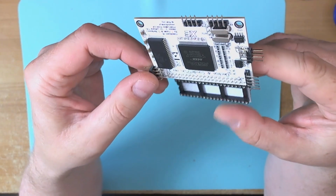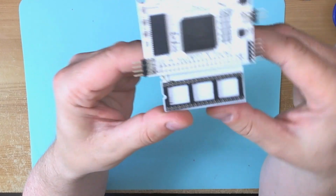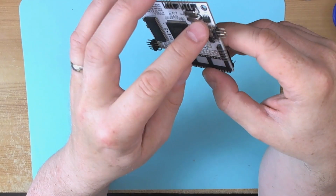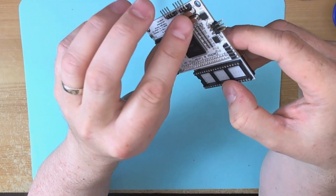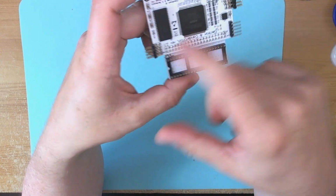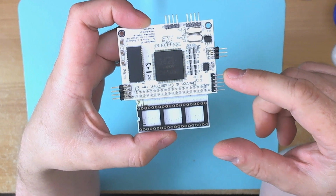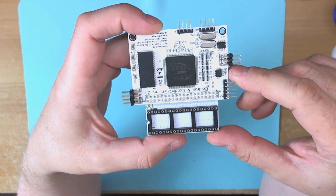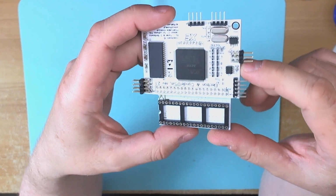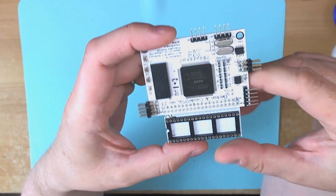This particular one's configured for an XL machine, so it's low profile, so the keyboard can go over the top here. It's based on an FPGA chip and an AVR chip. And this board actually supplies the master clock for the whole system. From this header here, you get 15 kHz RGB video, which you need to route to a video jack of your choosing. DIN 13 works well. So this sits in the Antic socket, and the Antic chip goes on top of here.